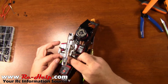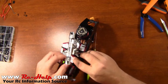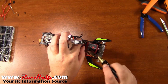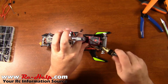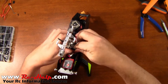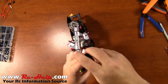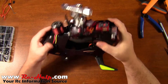The polarities — I really wish the brown was on top right here, that would make it a lot easier. Grab our four final screws, let's go ahead and get this guy on there. Scorpion tools, man — they fit these screws so well. There we go. Pop this ball link back on. Grab our screws to secure the gyro down. This will not be the last time we screw this down, so I'm not using any thread lock — we'll have to take it off to put the tail boom back on. And there we go.